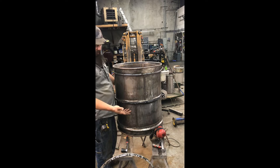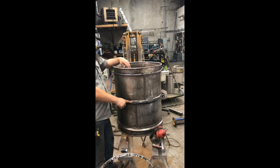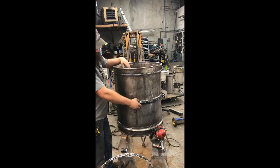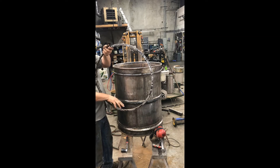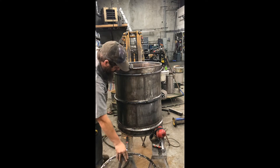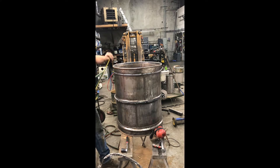We also need it together for the next piece. But I won't lie to you — that was a turd to get on there. Both of these barrels are used, they're bent up, they've already had a hard life, so these ribs were not straight. I went through and did a little massaging on both of them with a ball peen. Then I ended up taking the clamp ring over to the vise and using a ball peen to actually splay out the lips all the way around to be able to grab on and sink it down. But anyways, there's the hopper.